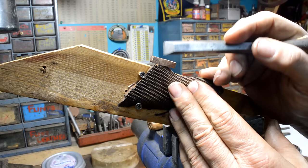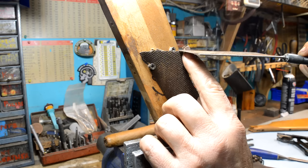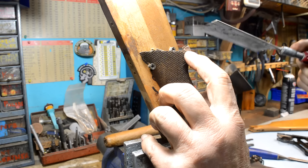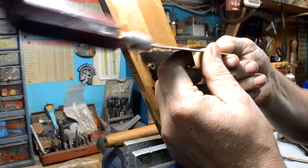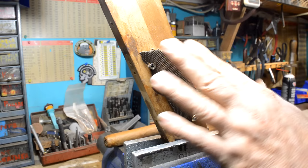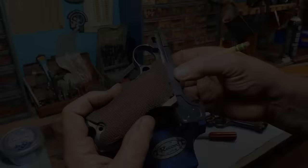The next thing I'm going to do is very gently back-saw this off - just straight across to get rid of this chunk of wood right here. I want to use a very fine-tooth back saw, resting on my finger like this. This is actually one of those places where a Japanese saw cutting on the pull stroke would actually be more advantageous. Steering on the pull stroke is unfamiliar to people raised using Western saws.